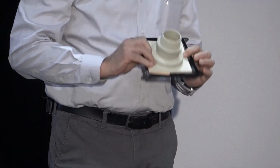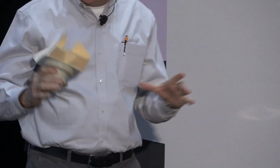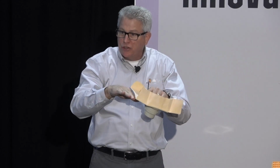We really are. So anyway, the nice thing about this drain, if you're familiar with our Kerdi drain, our point load drain, or our center drain, it has a 12-inch flange, bonding flange on it. And a lot of time you can't get that drain close enough to a wall because of the size of the flange. There's also places, because of the way the flange is built, it has a bit of a pitch to it to keep the water moving towards the drain.